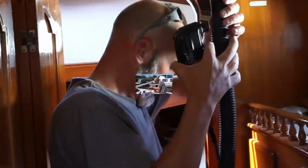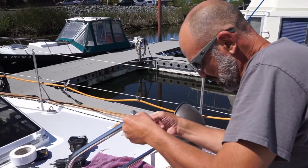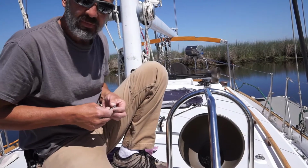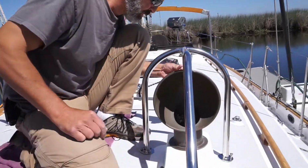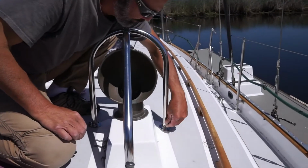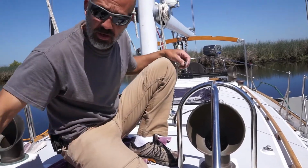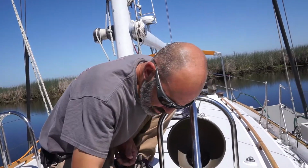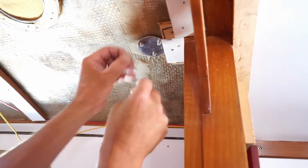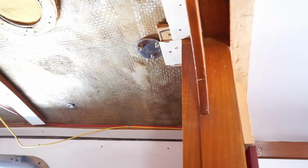You're going to hold it back? I'm using butyl tape, the good stuff from Compass Marine. So we're bedding the bottom of the plates with butyl and adding a little collar around the top of each screw that squeezes down and helps seal off the holes. And when I drilled the holes through, I also used a countersink bit to give it a little bit of a gasket forming ability. There it is. And lock washer. Lock washer and a nut, each one.